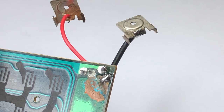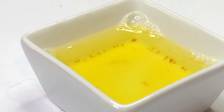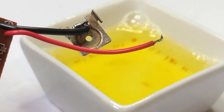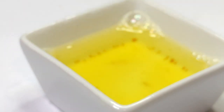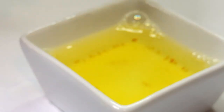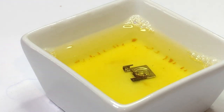There's that negative wire replaced and re-soldered in. That joint looks nice. So I've got that terminal off. That red wire looks okay to me — there's no evidence of it wicking up there. This terminal, I need to stabilize this rust. I'm just going to drop it into some Evapo-Rust and leave that for a while and see what it comes out like. But as long as I stabilize the rust, it'll be fine. There's still plenty of nice shiny metal there for the battery to make contact with, and the spot for me to solder the wire back on is okay. So just as long as it doesn't get any worse, that will be fine.